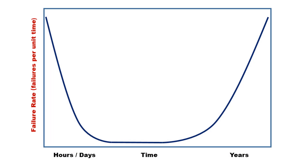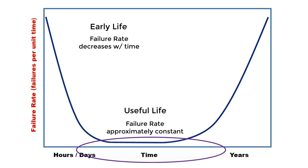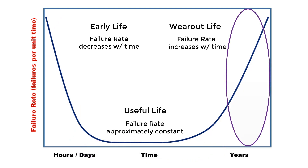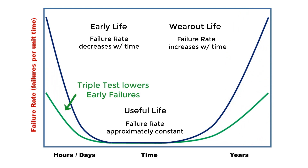At Microchip, we found that while anyone can ship ICs, the trick is to have none of them come back as broken parts. We call this a bathtub curve because it looks like a bathtub — it's an integrated circuit's lifetime. Let's say 1 million units passed all the tests and were shipped out to customers. Of these 1 million parts, some just barely passed the factory test and break quickly. Here in the middle are the working parts, and out here, some working parts fail with age. Our triple testing works here — fewer early failures and fewer age failures.